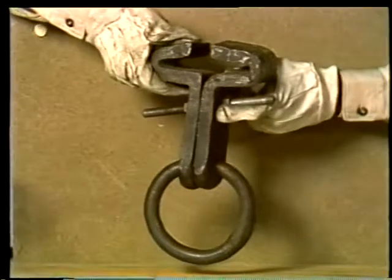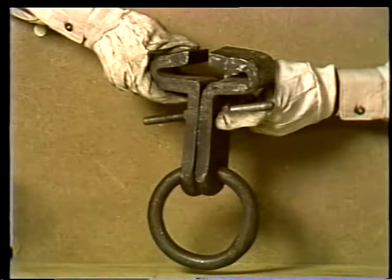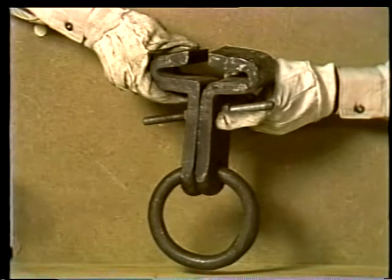Beam clamps are portable devices. They can be installed on any normal I-beam. So wherever there's a beam, you've got a place to hang a hoist. Pad eyes and beam clamps are definitely the best way to secure a hoist to the overhead. But unfortunately, it's not always quite that easy.